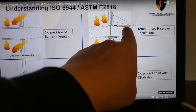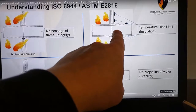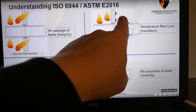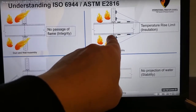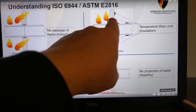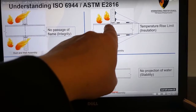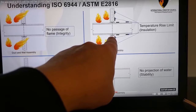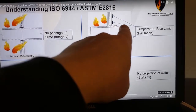That matters too, I don't mean to minimize that, but one thing they've kind of left out of this, check, don't take my word for it. Again, please assume I'm jiving you, but check some through penetration fire stop listings that have to do with fireproof ductwork. You will find that unlike this, there's more insulation used at the point of through penetration. Because this extra duct insulation forms part of the fire stop, it forces these thermocouples out of the danger zone.